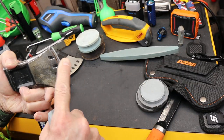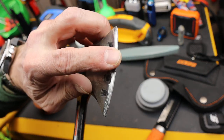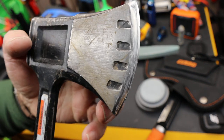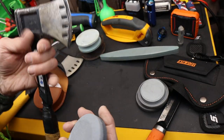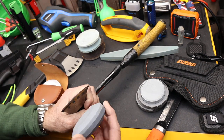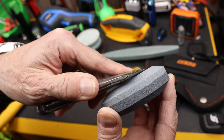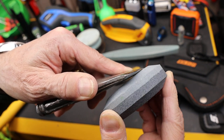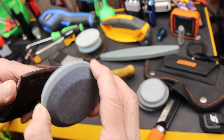So instead, you start out depending on how bad it is. This one is still fairly sharp but dinged up, and those dings I'm not going to get out anytime soon with a puck, but I can get it back into fighting shape. Find a way you can easily hold the tool, and unlike a knife, I'm not going to line the puck up right away with the edge — I'm going to work in an oval motion.